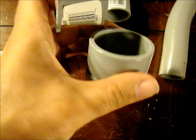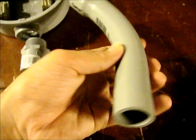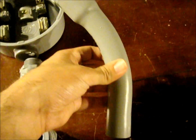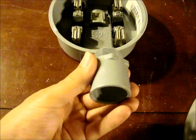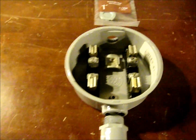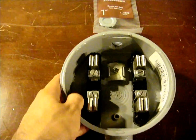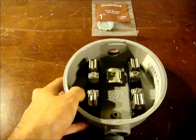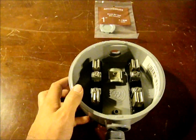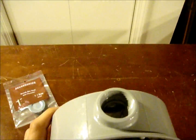You'll have a one-and-a-quarter-inch fitting and a reducer that will go from one-and-a-quarter to one-inch. I've got some one-inch PVC electrical conduit, which I'll cut. A one-inch PVC fitting will go into our meter socket. The meter socket is just an additional unit I'm adding for fun, so I can see the energy generated by my solar panel directly at the source. And I've got a one-inch cap that will go into my meter socket.